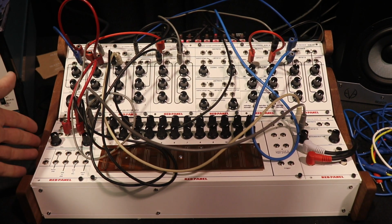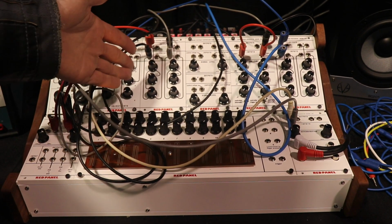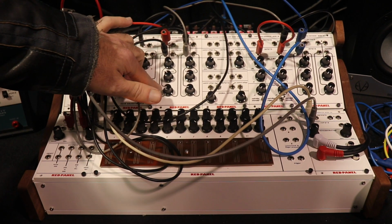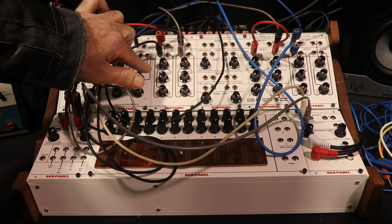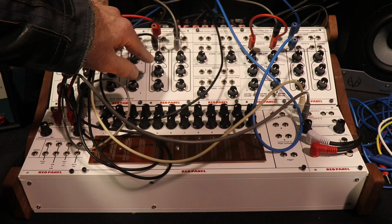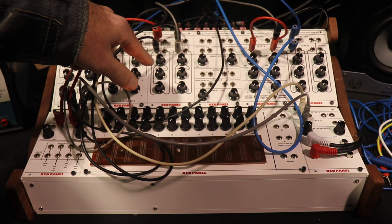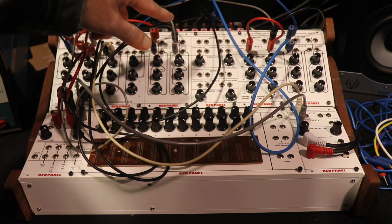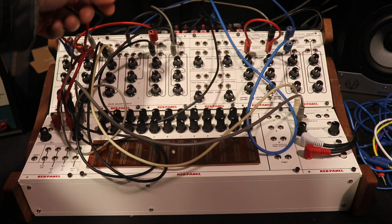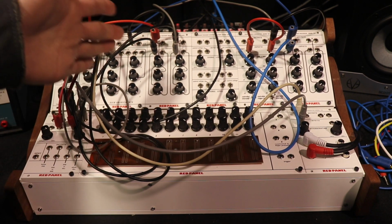How does the M model allow you to work better with Eurorack? So, the voltage is more in the same range? Yeah, so in this module, you've got 2 inputs. This lower knob mixes between the 2 inputs. The center knob functions as an offset, and it can go positive or negative. And then the top knob functions as an attenuverter. So you can scale positive up to about, multiply it by 2, or scale negative down to about 2. So that makes it very easy to scale voltages for things like pitch, if it's coming from something like a keyboard like this.